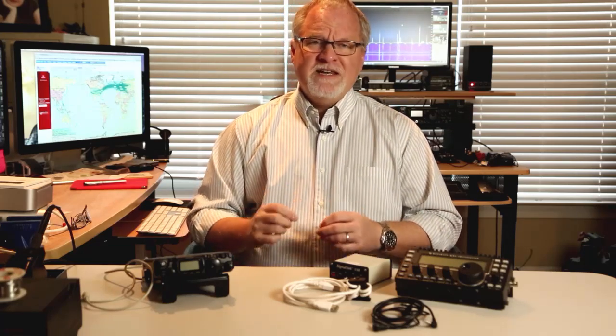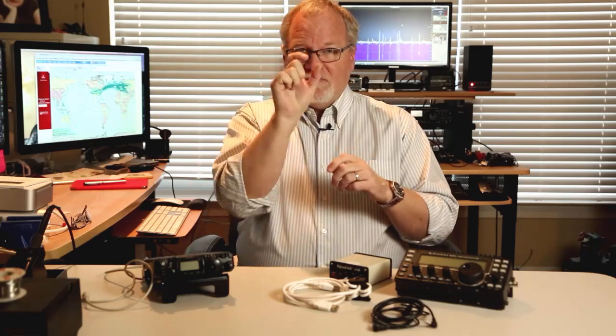If you saw my video called The Case for Morse Code, you might remember that I told you that CW uses more concentrated energy compared to the wider bandwidth voice modes, and so the signal just goes farther. And digital's like that. The digital modes tend to use a narrow bandwidth of focused energy, and so your QRP signal will go farther. Plus, there are other modes like JT65 that use forward error correction through data redundancy. So even if some of the data doesn't get through in your transmission, the message can still make it, which is pretty cool.